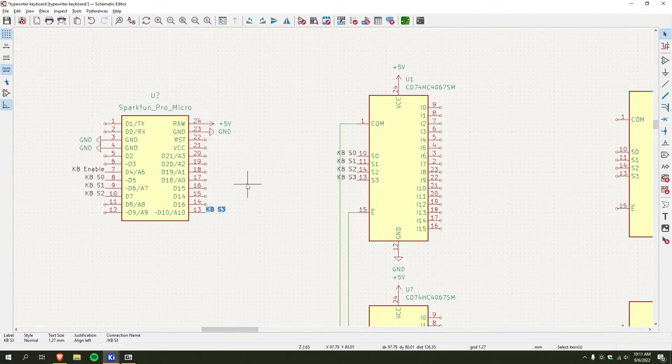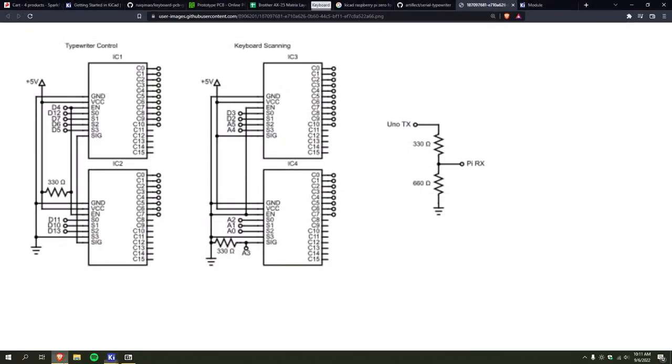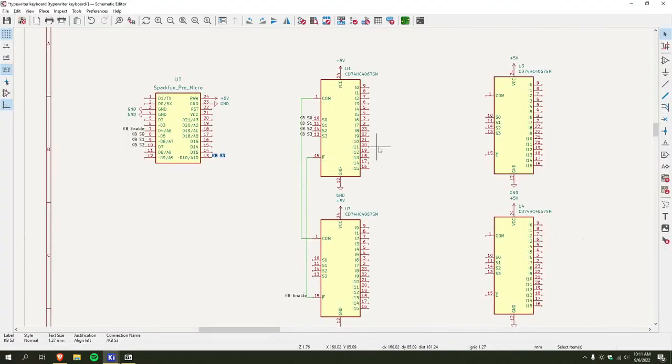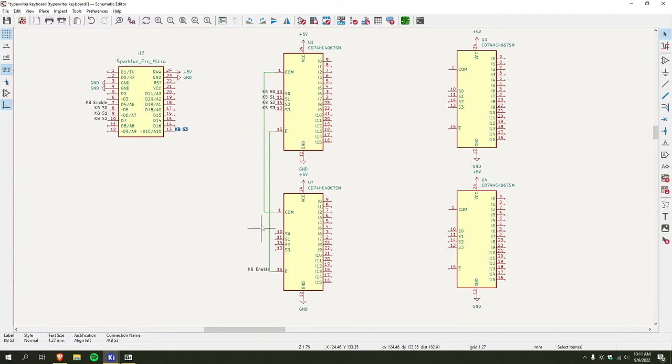And the reason I'm skipping over 8 and 9 is because the AltSoftSerial library uses those two pins. So I can't use them, sadly. It's a little annoying, but I can work with it. So I guess this makes that the 11-pin connector, multiplexer. And I also need to wire these up and ground the rest of them. But I'll do these ones next.